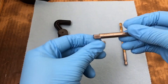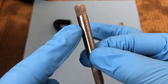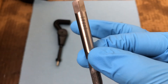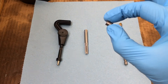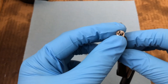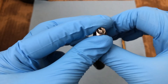It also comes with the tap. The cool thing about this tap is, if you lose the packaging, it has the requirements for the tap or for the coil that you're intending to use it with — pretty cool. And of course, you have the coil. Note that this has a tab on the end that you're going to use to insert. You insert the special tool in and this is going to be used to thread it into the new hole we create.